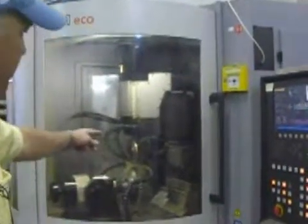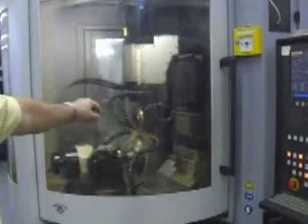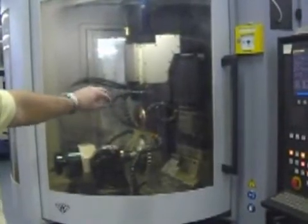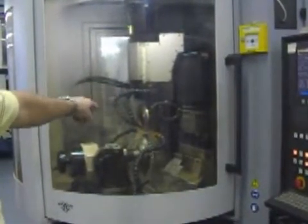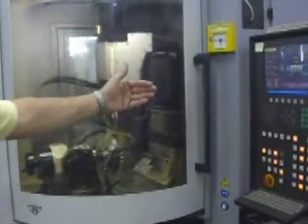You'll also notice the wheel that's eroding the diamond tool. After so many teeth, the wheel will get a black coating on it. You'll have to come over to the far corner of the machine and redress the wheel, which is recutting some of the excess material off the cutting wheel. Then it goes back to eroding — it gets a black film on it from the spark.